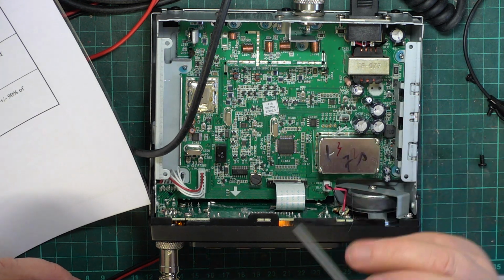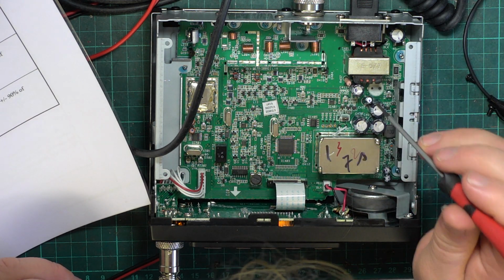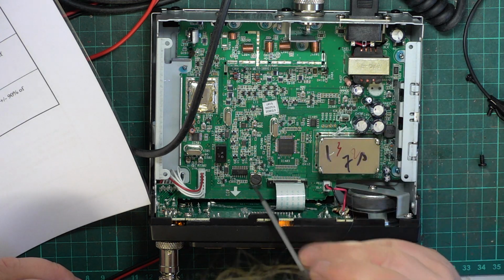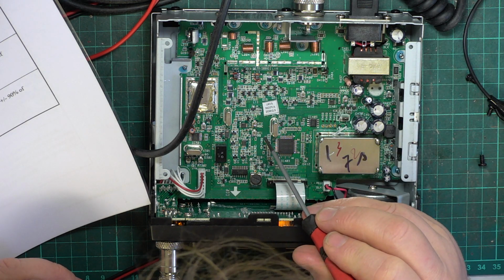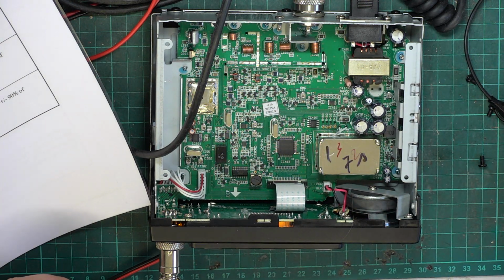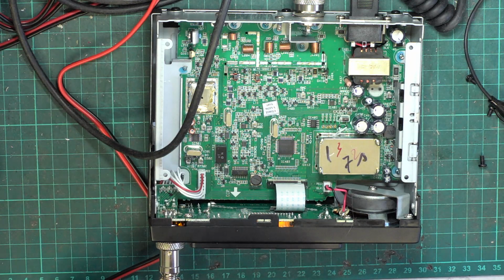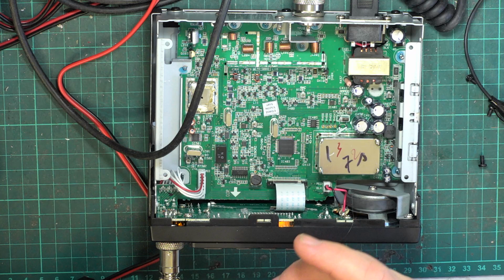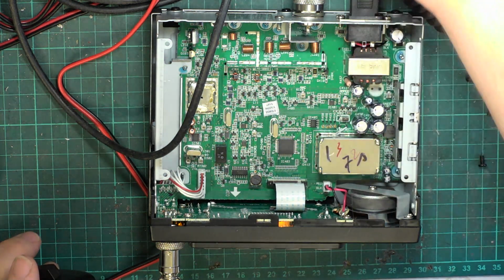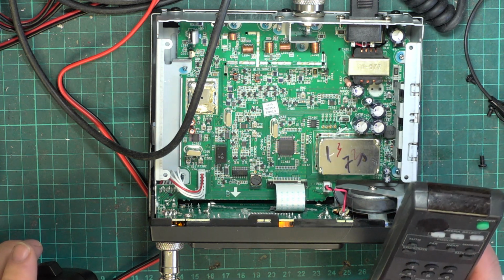So we've got the deviation, we've got the transmitted power. I've shown you where AM is for those of you wanting to do AM. We've got Squelch and Auto Squelch to set up. And I need to see whether that's the detector. So let's go over to receive. I'll put this no good service manual on one side. You never know, one will come in for repair next week and we've got the manual. I didn't realise there were several versions of this.